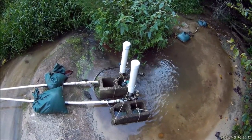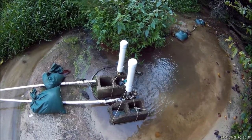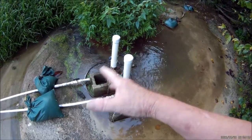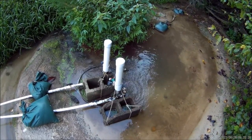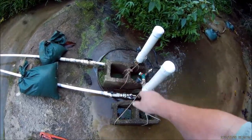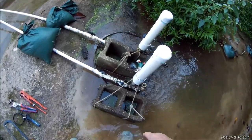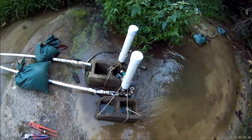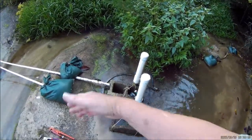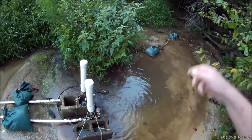Over the years I've lost several ram pumps due to flash floods — they just disappear. You'll see a lot of videos where people mount their ram pump onto a small board or piece of plywood. I've just got the top of an old metal barrel on mine to keep it from sinking into the sand, but I strongly recommend you get some heavy cinder blocks and tie your ram pump to those. If I have a flash flood it may tear up this system, but I don't think these ram pumps tied to a cinder block are going to get very far down this creek.